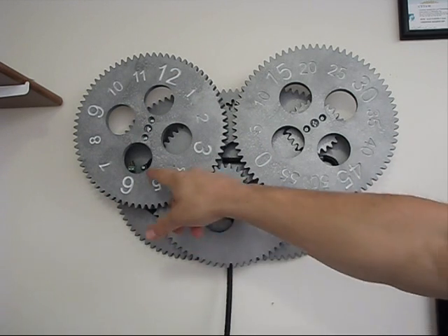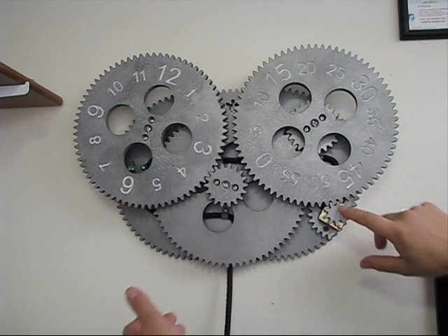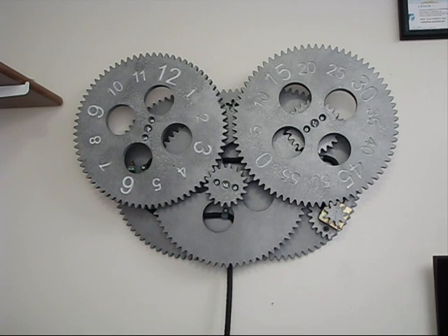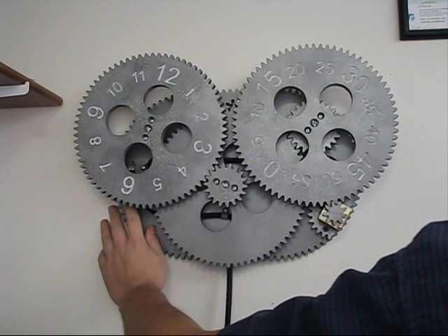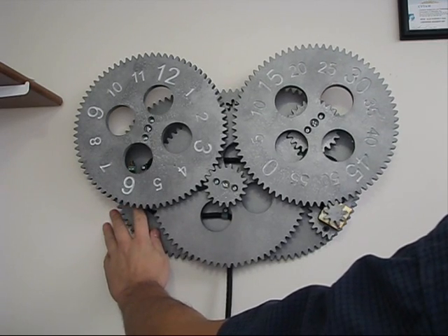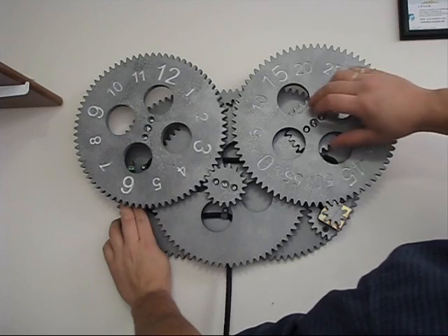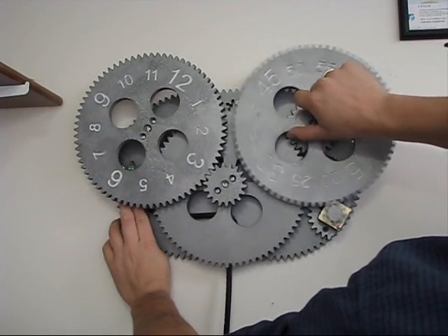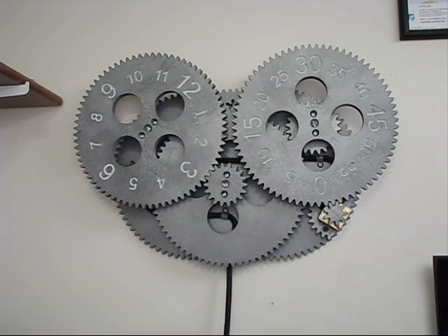There's a small circuit board behind here with a microcontroller on it, which handles the timing. There's a crystal oscillator on it, and every nine seconds it pulses four times. There are two buttons: one to increment time and one to decrement time. If you push both together, it releases the stepper so you can manually control time if it's more than a few minutes off. When you release them, it returns to automatic control.